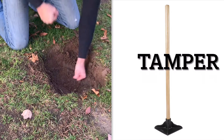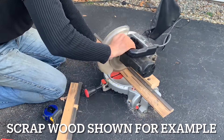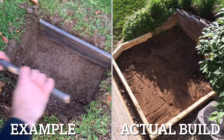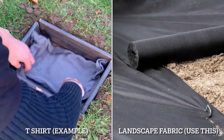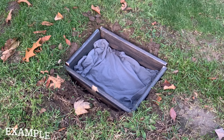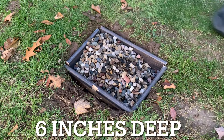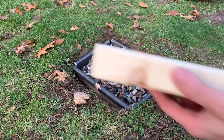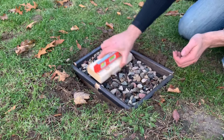Make sure the ground is compacted. Then build a border — you can use 2x8s; I used landscaping timbers because I like the finished look. Install your retaining border. I laid down a sheet of landscaping fabric as a barrier between the ground and the crushed concrete, which is not technically required, but I recommend it. Then fill it in with six inches of crushed concrete. I had a pile delivered to my driveway by a local landscaping company, then used a wheelbarrow to transport it to the hot tub. With the pit full, level it out — I went around with a 2x4 and a level on top.